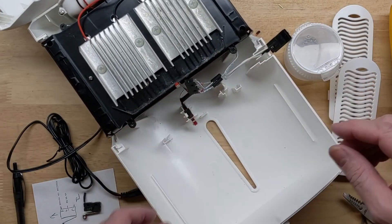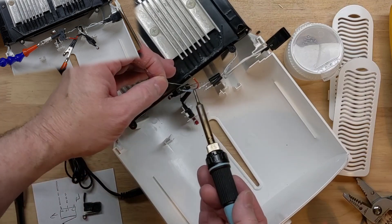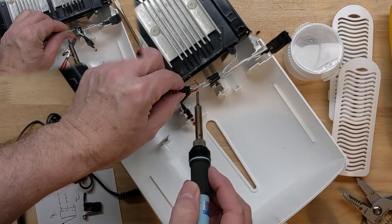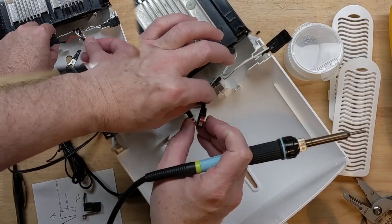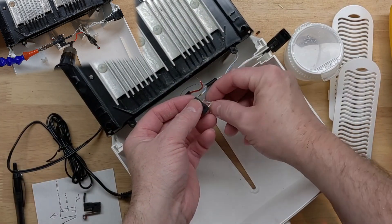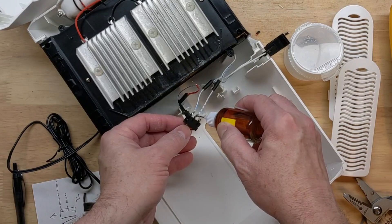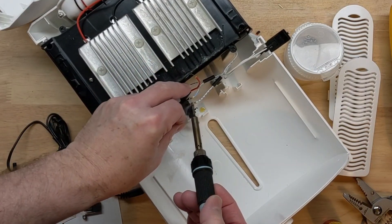These switches don't appear to have any DC rating, as far as I can tell. I'm also going to show the replacement of the left switch in the top-left corner, so you'll see I did both — I'm only showing one on the main part of the video. Direct current is a lot harder to break without arcing than AC, since AC rolls over zero with its sine wave crossing over. DC is constant, so breaking the current always creates a greater arc. If you look at the ratings on a lot of these switches, they'll be like 0.1 to 0.6 amps DC — so we are way over-using these switches.